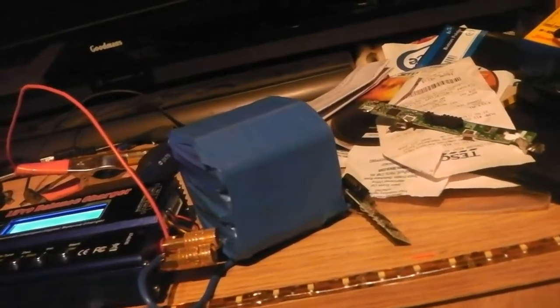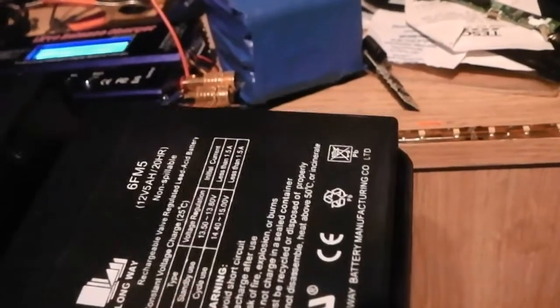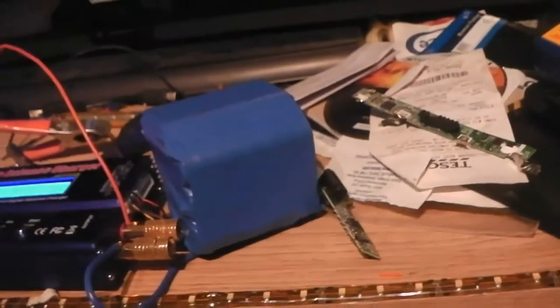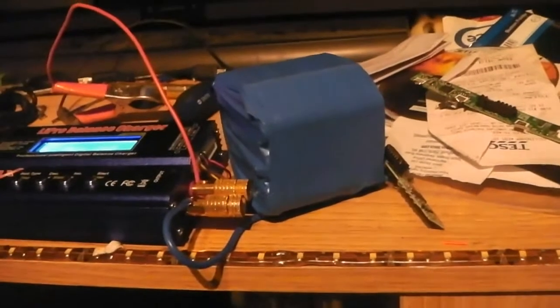In fact they threw out their entire laptop, so there could have been a lot more I could have scrounged. I've recently taken apart this small UPS system, which you might see in another video. It does have a 12 volt 5 amp hour lead acid battery in there which has died over time, and my idea is that I'll be able to replace it with lithium batteries - though I'll need to test if it can withstand the higher voltage.